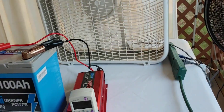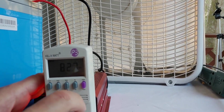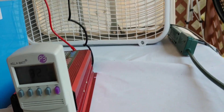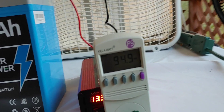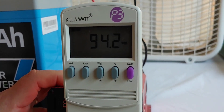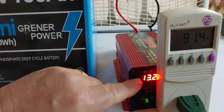Fans turned on. Let's take a look at our kilowatt meter and check the watts. Right now it's 81 to 82 — we need to get it a bit higher than that, so let's turn one of the fans on higher. All right, so we're at right around 95. As the test goes on the numbers will bounce around, and we want it really close to 100 without going over. As you can see, because we have a load on, the inverter dropped to 13.2 volts.